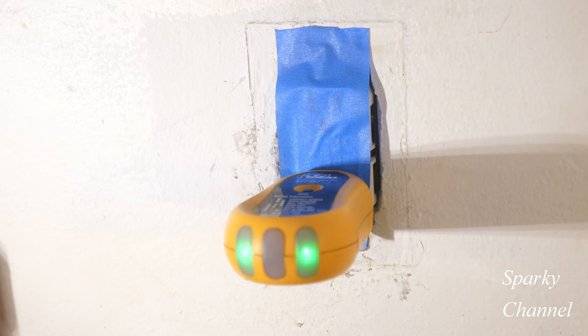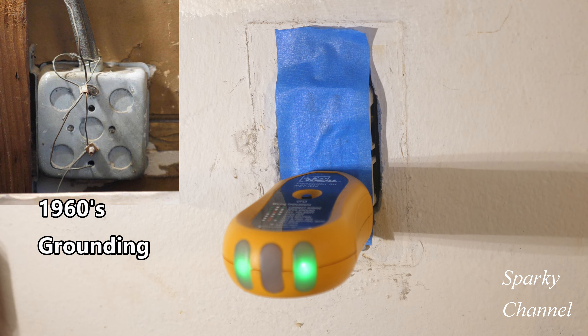So that's a cool tip. You're probably wondering why this reads as a correct ground, but I said no equipment ground. That's because this is an old 1960 house — it actually is grounded with the old 1960s style that doesn't really meet the code of today's NEC.